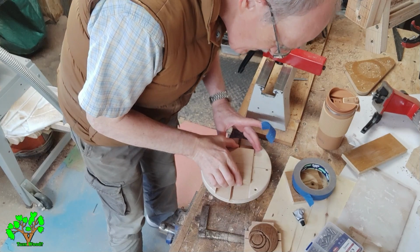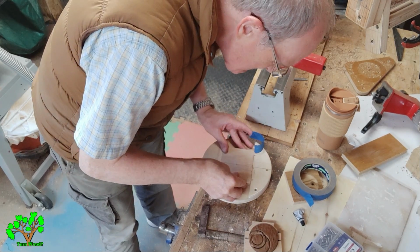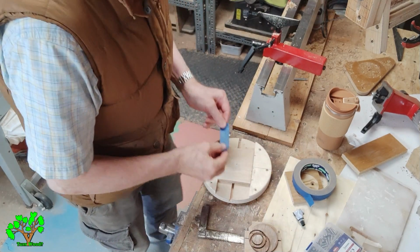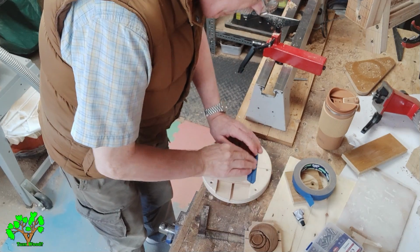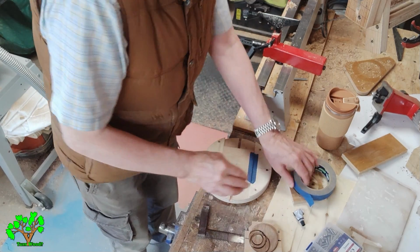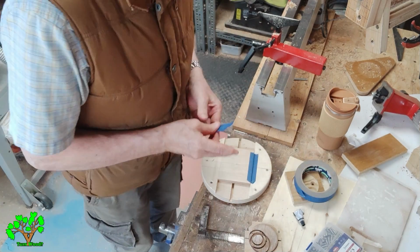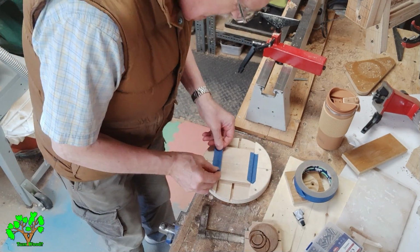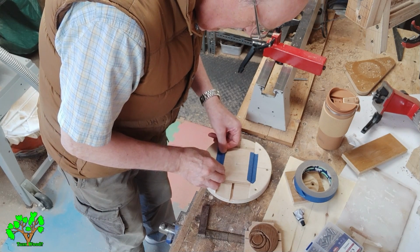In my previous videos with the eccentric jig or stroke chuck, I was relying on double-sided tape to hold the pendant in place. So I've decided to convert the pendant frame, as you can see, into a clamp, so that now we have a pendant clamp and hopefully do away with the annoying double-sided tape procedure.